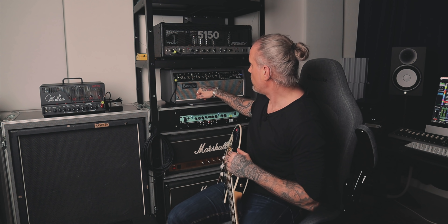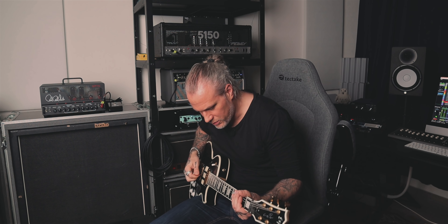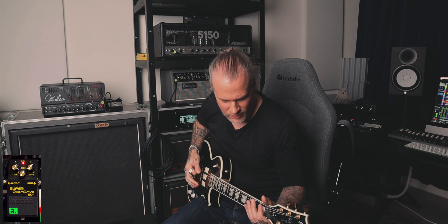I didn't prepare much for this video because I was just so inspired. It has two 5881 power amp tubes — I guess the previous versions had 6L6s — and then JJ ECC83, which is 12AX7. I have JJ ECC83S preamp tubes on pretty much all my amps, it's my favorite tube. One is driving the clean channel and the overdriven channel, one is probably the effects loop, and one is a phase inverter. You can make it 8 watts in triode mode; at 15 watts it's in pentode mode, which I like. The boogie I always use on pentode — the Mark 2C Plus channel — although the original Mark 2C Plus was wired in triode, but I like the feel and bigger headroom of pentode operation.